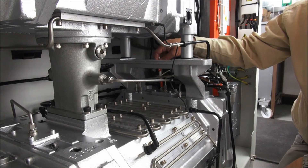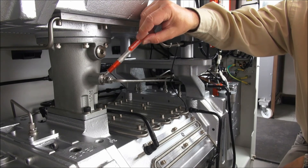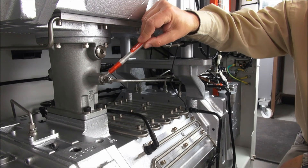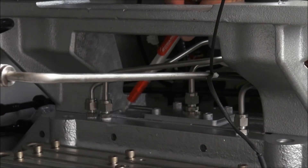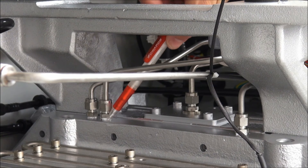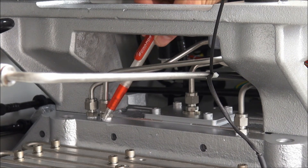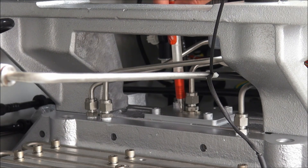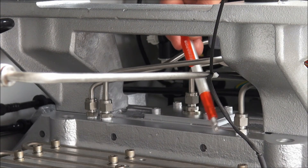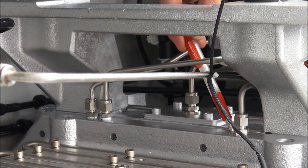When we go to the MD medium duty version, three things are added. First, there is the inlet purge system, purging through here, normally used during shutdown of the pump to provide clean nitrogen to flush the pump through as it shuts down — that connects in here. You can also see the gas ballast connections here. Because this is a larger pump, a GXS 450, we have two gas ballast connections: gas ballast one and gas ballast two side by side. The shaft seal purge is of course fitted to all pumps. There is also the exhaust pressure sensor system which connects through to the exhaust side of the pump and enables the pump to know the exhaust pressure and check for any blockages.